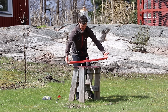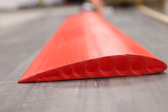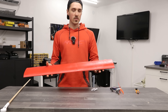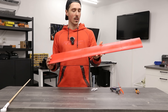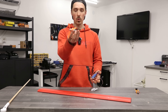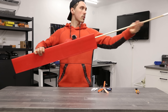That's a lot better. At this point I could sketch up a 3D printable mount for the motor — basically an adapter going from a round rod to a flat surface in order to mount the motor. As you can see, the wing was mostly hollow and I didn't think it would be too heavy. However, I still wanted to keep everything as light as possible. Super light wing, turned out really good. It's printed with lightweight PLA, about two perimeters, and I think the spray paint weighs about as much as the plastic itself. The next step is to mount the motor.